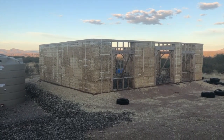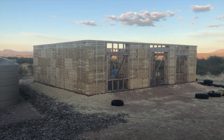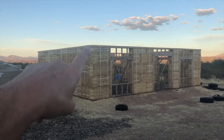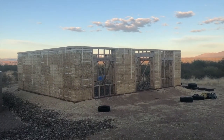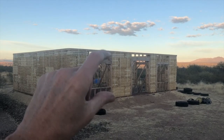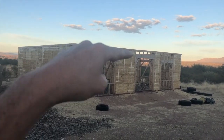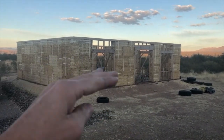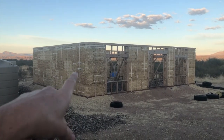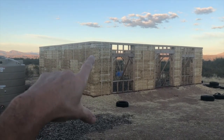I think I mentioned in something Pam was videotaping, I'm not sure if it'll end up here or not, so I'll repeat it. I spent a few days, if not several days, shaving out some extra straw at the top. It turns out because all the bales are different, some of them did compress, like my test, which actually was right here. Some of them did compress the 3-4 inches and went right down to the box beam pretty quickly, the bucks. Now I did work around slowly, little by little, around the structure, cranking down inside, outside, moving around. But some of them came down easier than others, and some were never going to come down at all. This was a corner, I believe, where no matter what I did, no matter how hard I squeezed, it just wouldn't come down all the way.